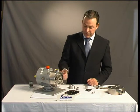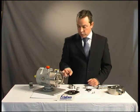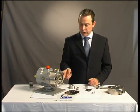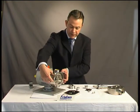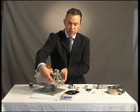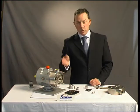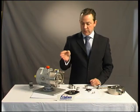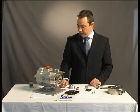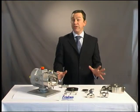We can also fit heating jackets, and the holes and channels are actually drilled through the pump housing itself, rather than only having saddles on each side of the pump. This means the heat or cooling can get to the best place possible — to the product around the mechanical seal area.